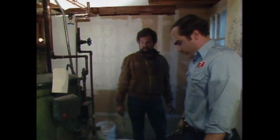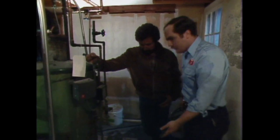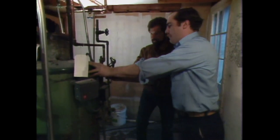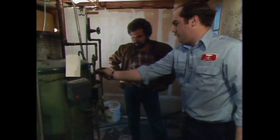Well, Richard, you're telling me this time it's terminal, huh? Well, this week we discovered that the steel boiler here has leaked onto the floor, and being as old as it is, it really wouldn't warrant trying to fix it. A steel boiler you can often attempt to weld, but a 25-year-old boiler in this condition, it wouldn't warrant it.